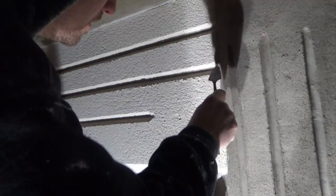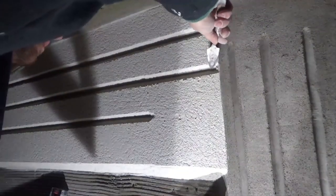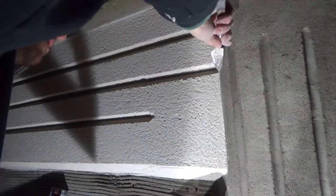If you did need to do something small one day, frostproofer and accelerators will be your friend. But bear in mind, something like that, you're going to have to really take your measurements seriously. If you're going to put in a full bag, then whatever water and frostproofer has to go in needs to be exact. Otherwise, it will change the colours. It'll look like an army pattern on the thing. Whereas when you're just going clean water and k-rend, it won't matter so much with the mixes. You will want to have a very, very similar consistency. But again, if you're watching my videos, you'll see that I do a nice creamy coat at the very end just to close everything in and lock it down ready for the scratch coat the following day.